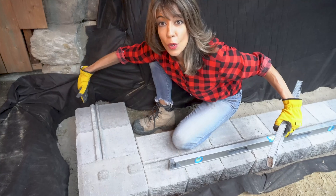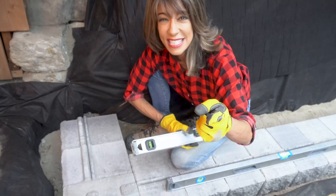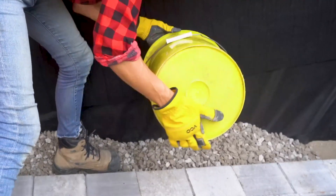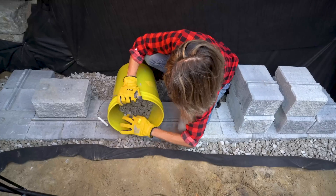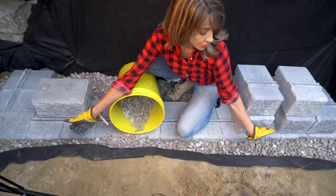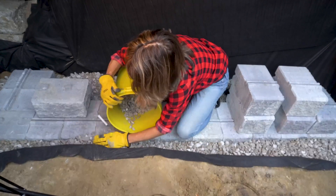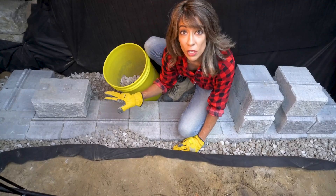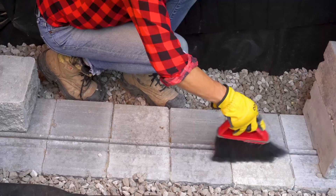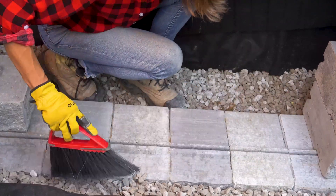Let's fill this area with gravel to maintain the work we just did because it looks really fantastic. You guys are gonna save like $10,000 to $20,000 by doing this yourself. So let's get on to step number two: reinforcing it. After filling the back, I'm going to fill the front of the trench as well — it has to have clean fill. The reason we're doing this is to lock our blocks in place. Always clean before you move on to your second course — very important.